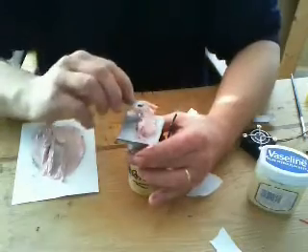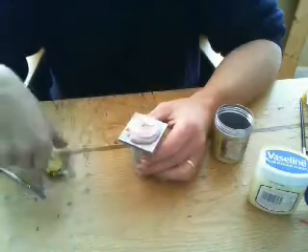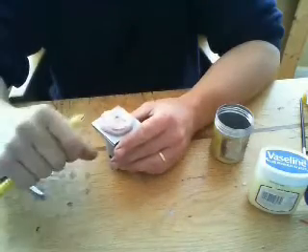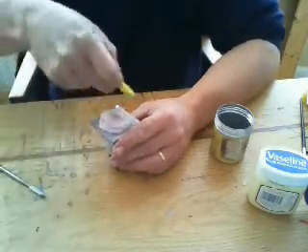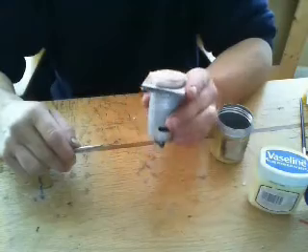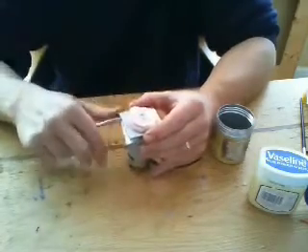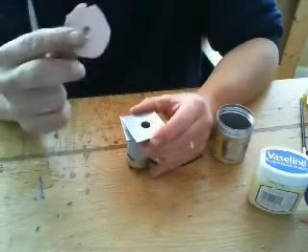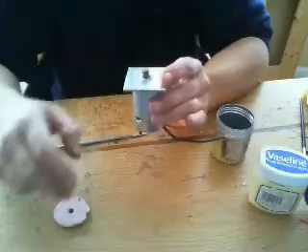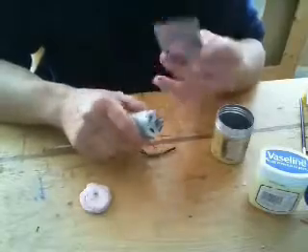Now what you want to do is just apply it — smear it on. As this stuff cures it gets to a sort of midpoint when it's like a jelly, but when it's like a jelly it's really easy to cut with a trimming knife. So when it gets to its jelly stage just trim it off a little bit. It saves a little work in the next stage, though it doesn't actually matter that much if you don't do it. Trim it round into a rough circle. Now if you separate it off, those two plates that you put on there just separate out with a spatula or screwdriver and gently tease it off. And there we go — we have our disc with its cast cog. And we have our mounting plate, so we'll be able to put that disc back on there.